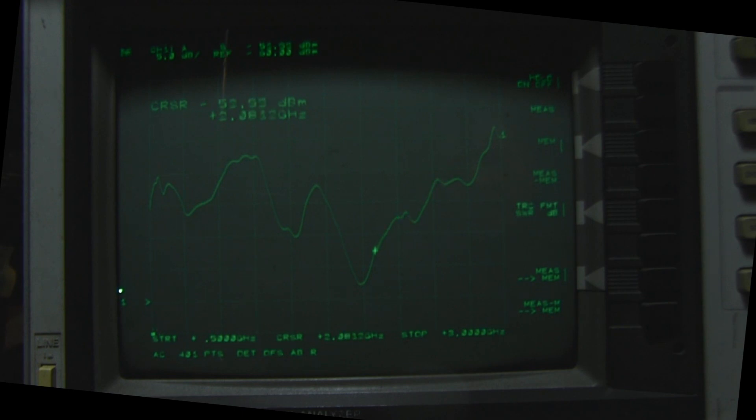So I do think this is a 3G Yagi that's just been rebranded as 4G - it's certainly not responsive in those higher frequencies. We've got a nice dip around 2 GHz, 1.9 GHz. There's a secondary response around 1.5 GHz, which I don't think is intentional - it's probably just down to the design of the Yagi. And there's a frequency response around the 700, 800, 900 MHz range. Not particularly impressive.